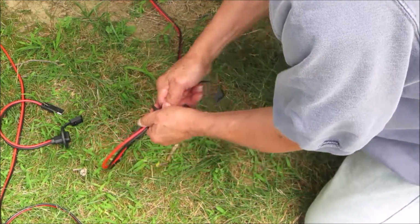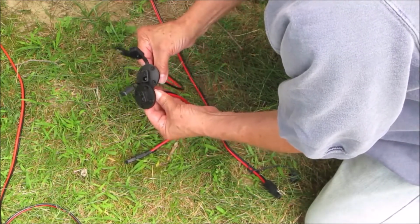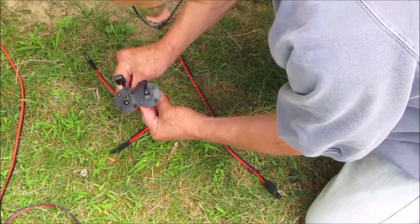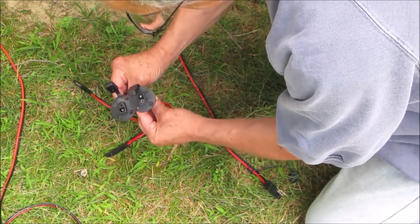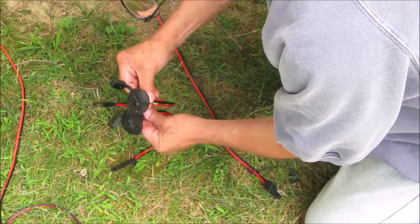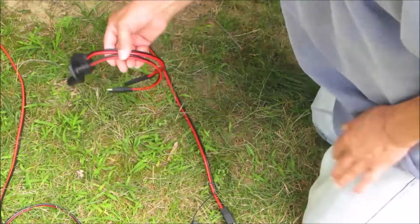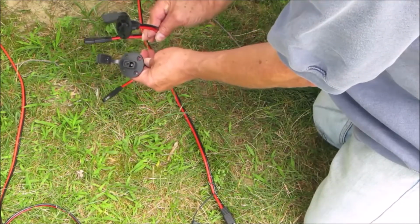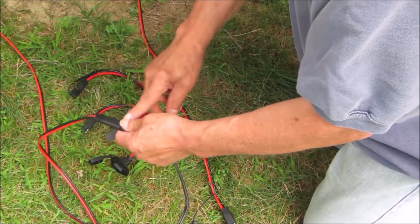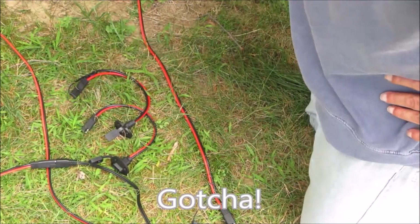How can that be? Because it's not whether the red is on the top or the bottom, it's whether it's on the female socket or not. And you'll see that both of these, even though they're upside down from each other, both of these have red expecting the male pin. Both of them. And the system requires that red accept the female pin. So both of these cause you to have a reverse polarity error that you have to correct by putting this in backwards so that you have two mistakes makes one correction. It's crazy. It's another gotcha. And that's why I'm showing it to you.